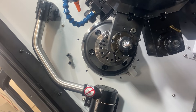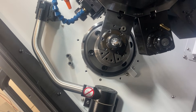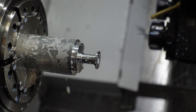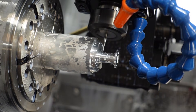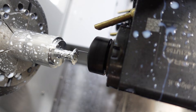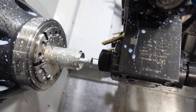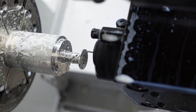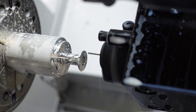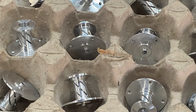Here's the Y-axis — the full travel is being shown here, which is a very cool feature of this machine because it basically makes it where it's not just a lathe. It really is a mill. You can even make purely mill parts on this thing if you can do it. Here we are doing some tiny little end mills, tiny little drills, and here's a tiny tap. Very useful machine to just finish parts in one operation and be pretty hands-free.